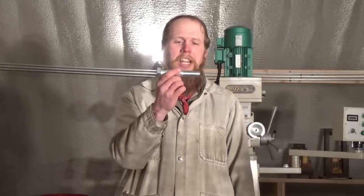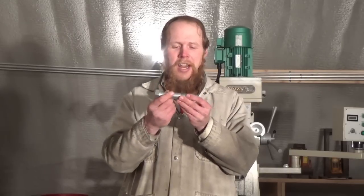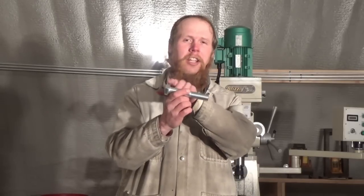For the barrel we'll need a piece of steel. You could start with an ordinary piece of round bar stock, but I'm actually going to start with this 7/8-14 grade 8 bolt. There are a couple of advantages: I plan to eventually thread this into a receiver, so already having the threads saves me a threading operation. Secondly, bolts are graded by tensile strength, so a grade 5 or grade 8 bolt has better tensile strength than mild steel or an annealed alloy steel bar. This bolt is a little longer than I want, so I'll cut a bit off the end and cut the head off.